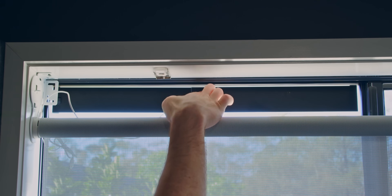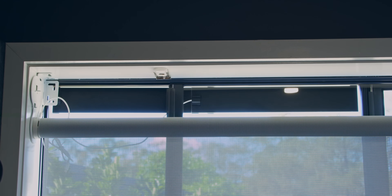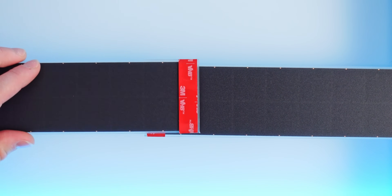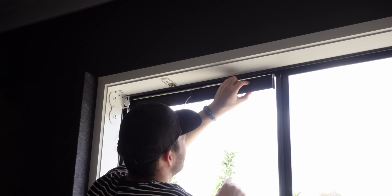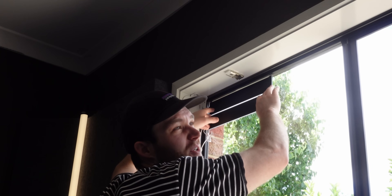Another mistake, another day. I overlapped solar panels in the studio so you wouldn't see them on camera and they were just thin enough to fit behind the sliding window. I was pretty proud of this, but then I realized some of the cells were small enough to be blocked - so it wasn't charging one of the blinds at all. Since heat damages solar panels, I opted for fishing line to remove the adhesive. When I cut new double-sided tape, I ensured it didn't cover any of the cells. It's going to be visible in videos though, which is kind of annoying.